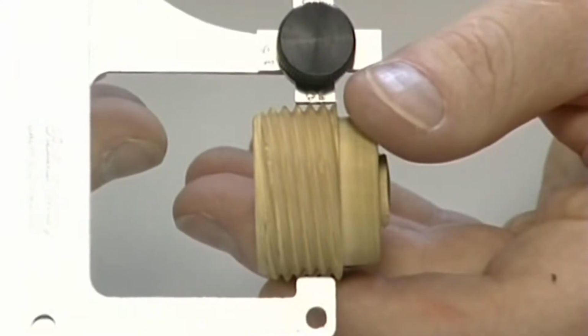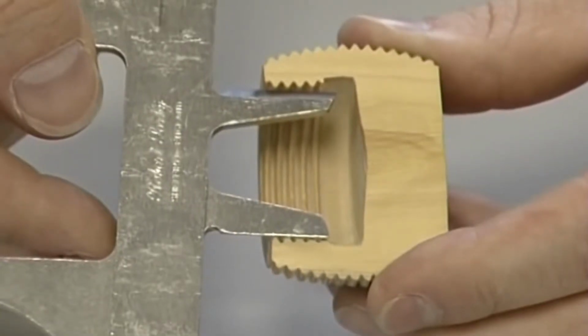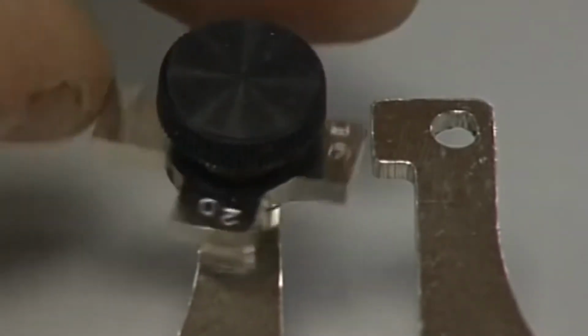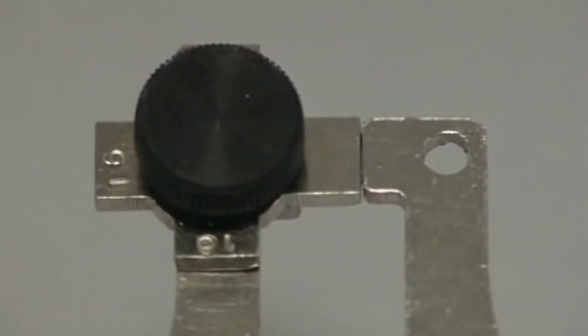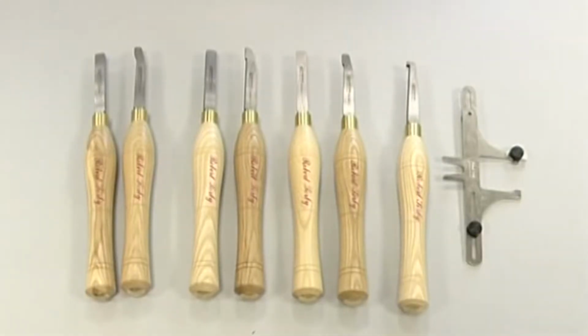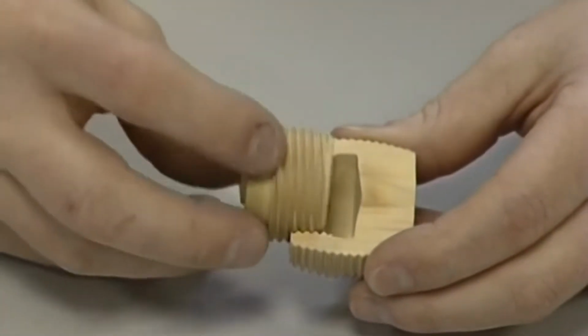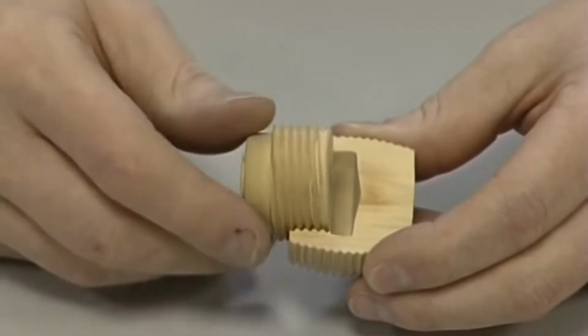It enables you to calculate the differential between internal and external threads and is calibrated to suit 10, 16 or 20 threads per inch. This is done by means of a preset anvil which is stamped with numbers corresponding to the size of thread cutter being used. There is also an unmarked anvil which enables sizing before creating a push fit. Together, these tools make a comprehensive package designed to take the mystique out of cutting threads by hand. This section view clearly shows how the external and internal threads fit together. Any inaccuracy between the two will leave the fit either too tight or too loose.